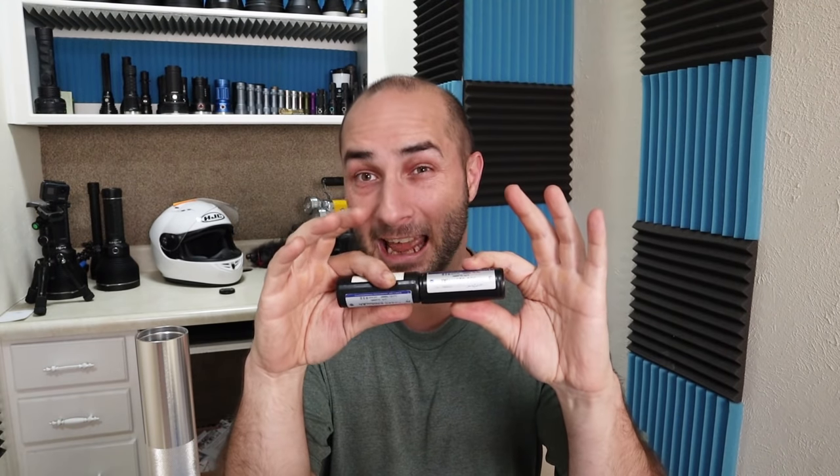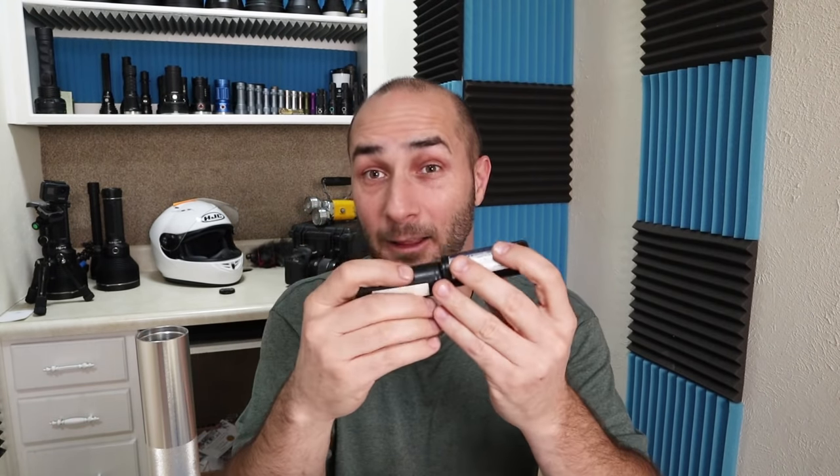This usually only happens if you're using alkaline batteries. Alkaline batteries wear out pretty quick, so remember, you're only going to get probably 20 minutes out of a new set of those anyway. So if you have batteries with 15 minutes time on them and then that happens. Or if all your batteries are brand new and you happen to get one out of the package that was weak, you're basically running on 5 cells, that would also happen. If you're using lithium ion batteries and that happens, it could be that one of the protection circuits on them is getting triggered, or you have a weak cell. A weak connection is possible. But basically, if you get that high mode and then those rapid step downs, it's a battery issue.